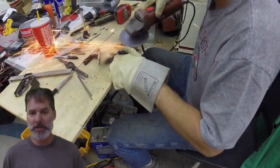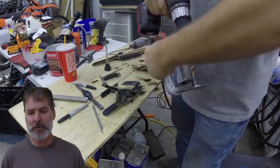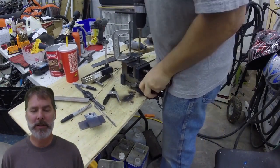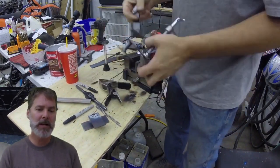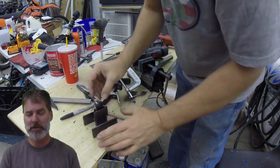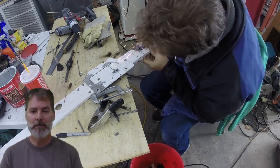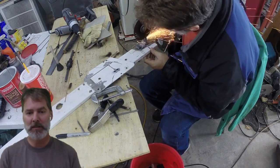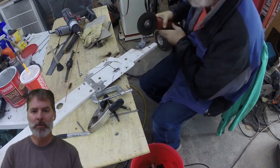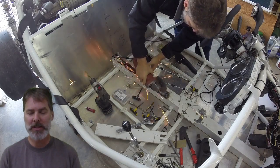Bruce, or Bar Air as he's known on the forum, sent me a Fiero shifter. The Fiero shifter was designed to have the cables attaching to the back, which is basically what we need for a mid-engine car. That got me thinking, because in this case the RSX shifter was designed to go to the firewall — the engine's in front of an RSX. So spinning it around is running it in reverse of what it was designed for. Both shifters had the same problem where one of the cables is reversed from the way our transmission is set up.